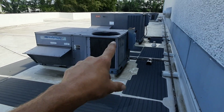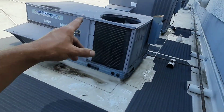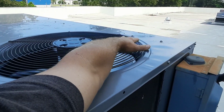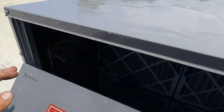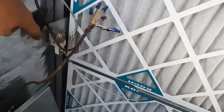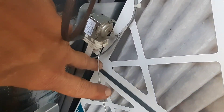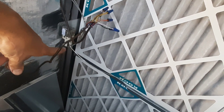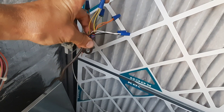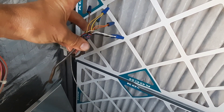All right, so we got new mixed with old. I got cooling here, I got cooling here. This feels a little cold — maybe it's one stage. Open this up. First thing I notice is this — it's like a temperature switch, freeze stat or something. It's broke. So that's gonna have something blocked out, I would assume. The economizer here — this looks like a two-stage unit and maybe they're using orange for second stage. Let's get into the control panel on this one.